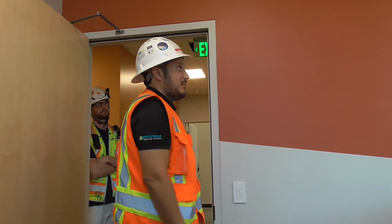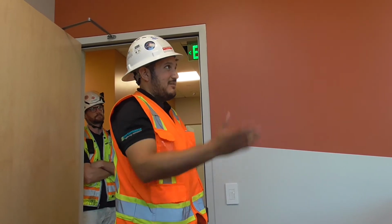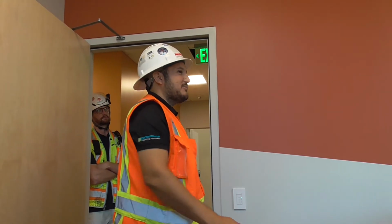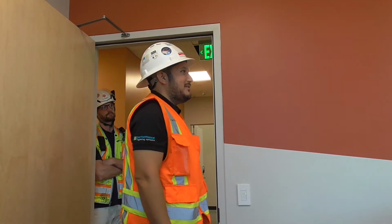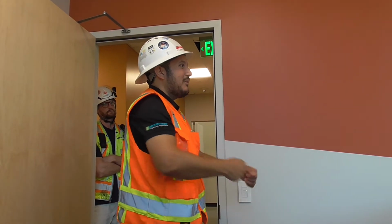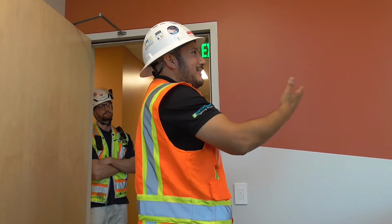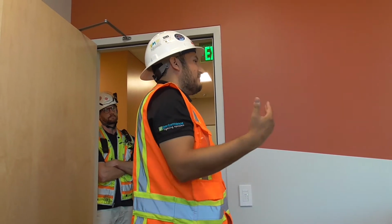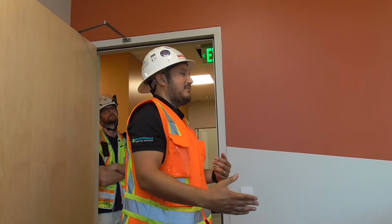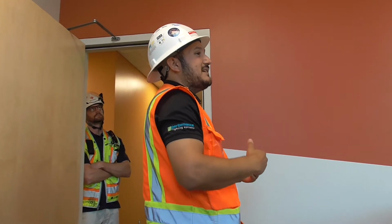Right now we have a couple of tiles open, it's fine. I've been on job sites where we've programmed it, and they still had tiles open. We leave it, and we get a call like a week later that none of the switches and sensors are working. We start doing some more digging and talking, and oh yeah, they pulled the tile up. When they pulled the tile up, they unplugged a bunch of the Cat 5s and never plugged them back in. I'm not saying that's what's going to happen here. I'm just trying to give you guys examples. Since everything is tied in series and you get power to these devices over the Cat 5, if you start seeing that there's no power here, there's nothing to the sensor, you need to start tracing things out.